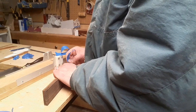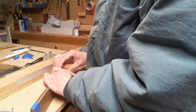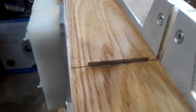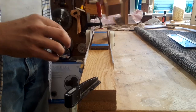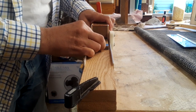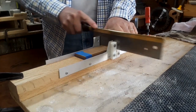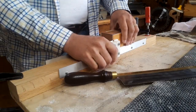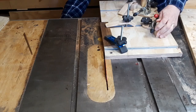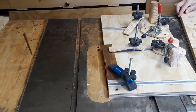To make the fretboard, the slots are cut, the board is tapered to shape, glued onto the neck, and then the frets are pressed or hammered in. On this slot-cutting jig — another shop-made tool — indexing is done by cutting a slot into the bottom board of the jig and a dulled razor blade is pressed into the slot. I have a store-bought fretboard that is carefully matched up and taped to my blank; each slot in the store-bought board fits onto the razor blade below, allowing me to make a perfectly placed cut in my blank above. The depth gauge for the cuts is simple but accurate. After the slots are cut, the board is tapered on my multi-sled — an easy tool to make, with a build link below.